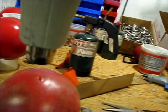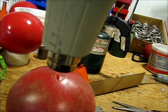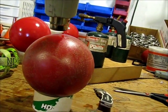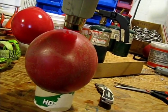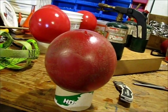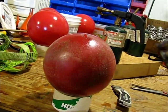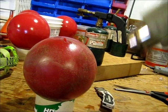Basically what I'm going to be doing is heating this thing up until it is much, much hotter than it was before — it's going to be liquidy, very soft — and I'm going to use the box cutter to kind of slather the plastic back together. It's actually smart to not just keep holding the gun on it; you can heat it up for a while and then take it off, and that's going to allow the heat to work its way from the outside to the inside. You need to heat it fairly gradually — it takes several hundred degrees to get this plastic to be more malleable.